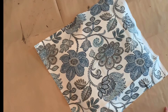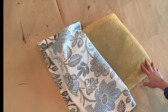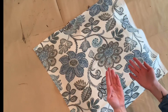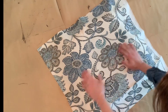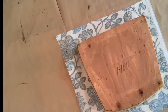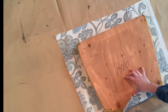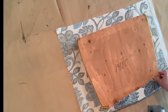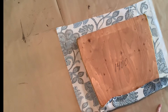What I've done here is pre-cut and measured the fabric to the chair cushion itself. I always leave about two or three inches around each side so there's enough room to fold it over and you're not stuck for space. I line it up, fold over on one side, give it a staple, go a little further — making sure you pull it tight as you go. I'm going to go all the way around doing the same process.